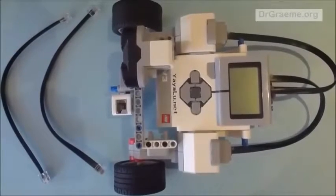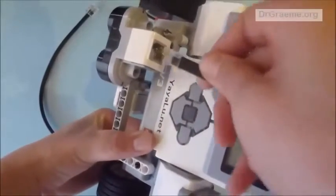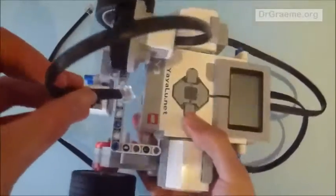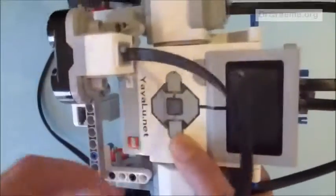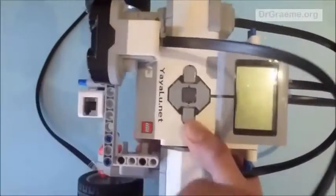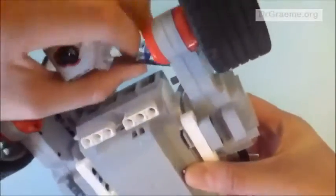Last but not least, we are going to attach the cables for the sensors at the front — starting with the sonar sensor. Remember to align the flaps with the cut-out. Note that I have used the shortest length cables, because it is much easier to plug them in and it makes the build more compact. This can be very difficult, so work carefully and slowly — otherwise the cable may become too twisted. Loop the cable through the hole, come through the other side, and pull it.